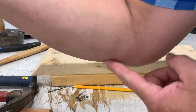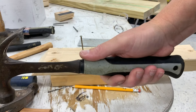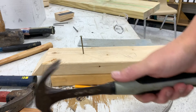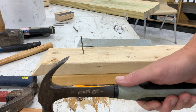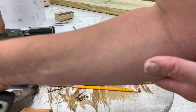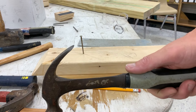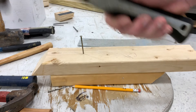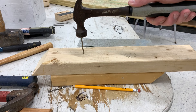The magic of this comes from the elbow and from the wrist, because as I come down, I'm going to bring my wrist in a little snap. I don't have to lift my arm very far — I can drive a nail with just my wrist if I want to. If I've got a heavier nail, I'll involve the whole arm, but all I'm moving is the lower part of my arm. As I come down with the hammer, I'm going to give a little snap with the wrist, and I'm going to try to meet that nail head perfectly square every time.